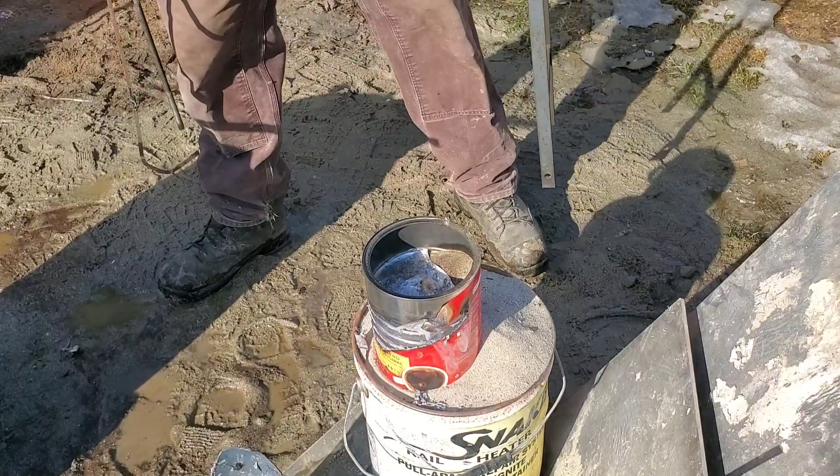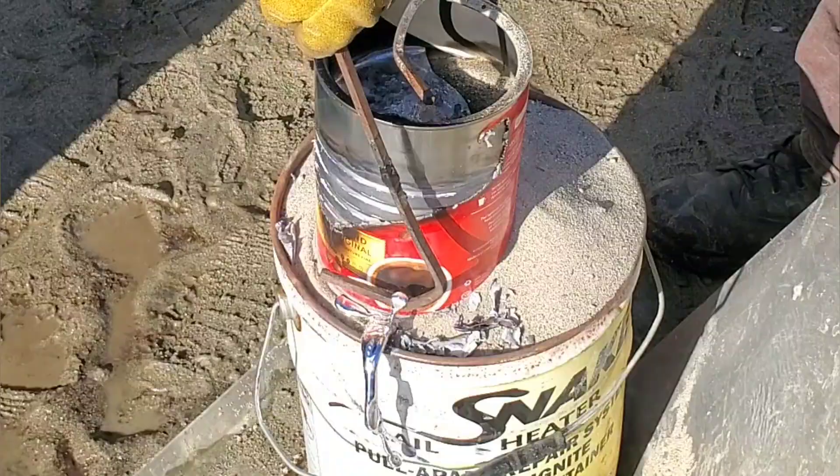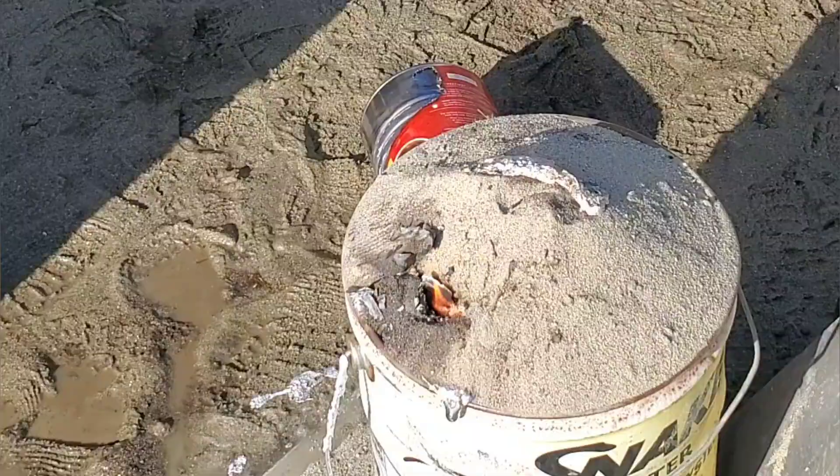Now I'll take the time to demonstrate a small hazard. You probably noticed the aluminum plates to the right of your screen — I intentionally put these there to protect my legs from getting caught by molten aluminum. I tilt the bucket back to simulate a blowout and it shot out about two feet, safely landing on the ground far away from me in some sand.